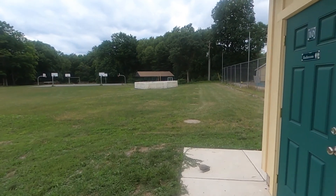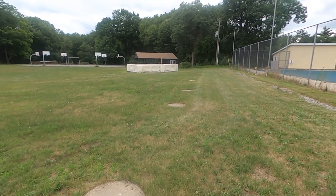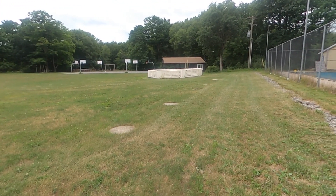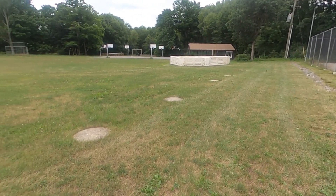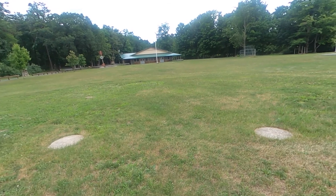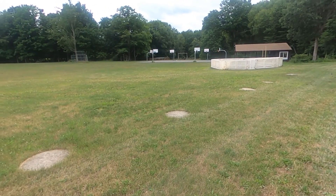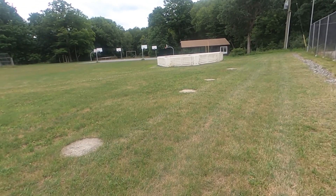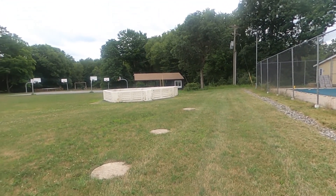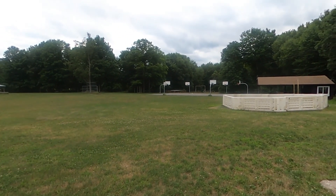At the beginning, it all works about the same. You might have seen these manhole covers here on the parade field — all cement manhole covers. These are each 2,000-gallon tanks for the septic system at the pool and pool shower house. It works the same exact way: all the waste from the showers and toilets head into the first tank, the solids either settle down or some float, and then as everything pushes through it's all liquids. All these liquids will work their way through and then, using gravity, pipe down around sports, back through the basketball court, down through the old campfire area and over towards the Rescue Rangers and Scout Craft area.